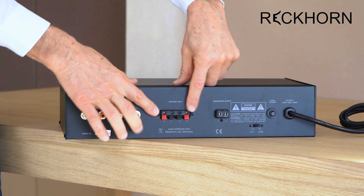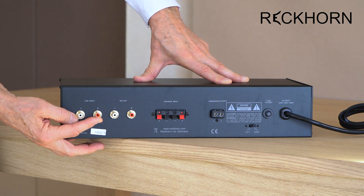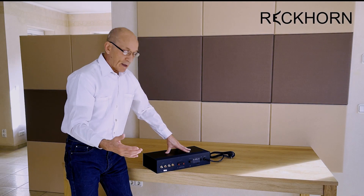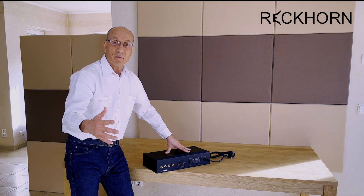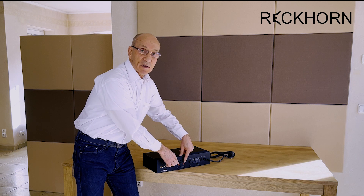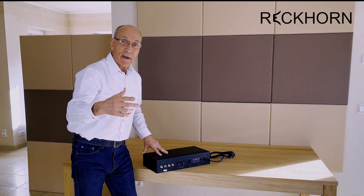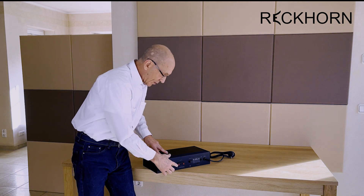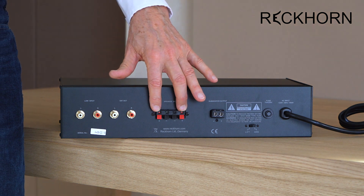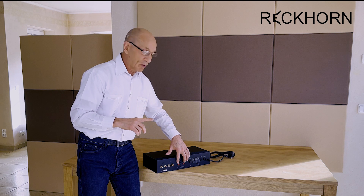This is the alternate input. If you don't have an RCA input from your preamp — for example, if you have a full-range amp without any RCA output — you can use your speaker cables, just run thin wires in parallel to your speakers, left and right. You're sending the signal from your main amp into this input through the speaker cable.